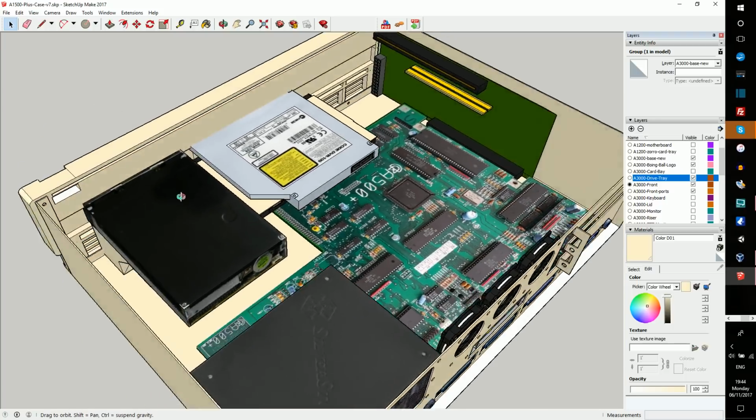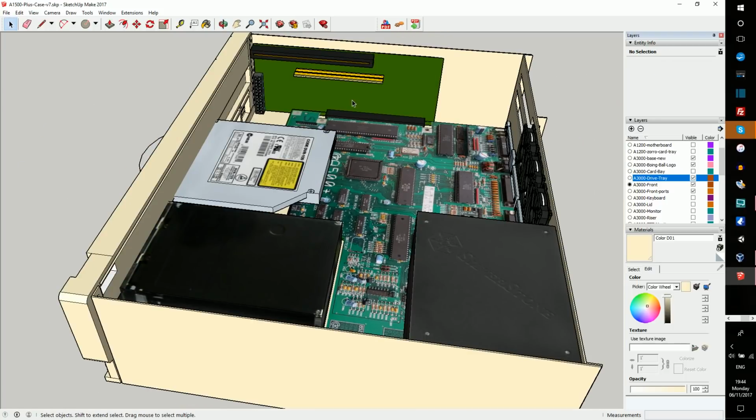The boards are going to be an interesting one because there's obviously issues with slots. Yes, I know I've got to get hold of slots. They are available. They're probably going to cost a bit, but also there's tons of potential here. So I will get a board made that plugs into the side and we'll have a Zorro 2 slot, or if you see this little slot here, that's a bus extender. So the bus will be extended to there. And then you'll be able to plug in an ACA 500 Plus or other cards of that type that will fit in there.